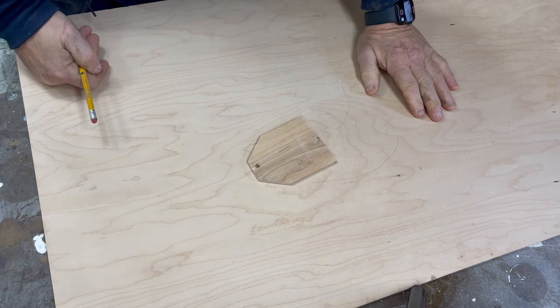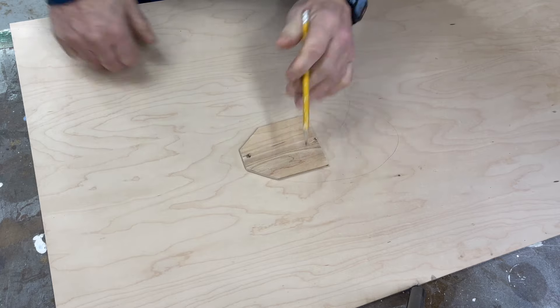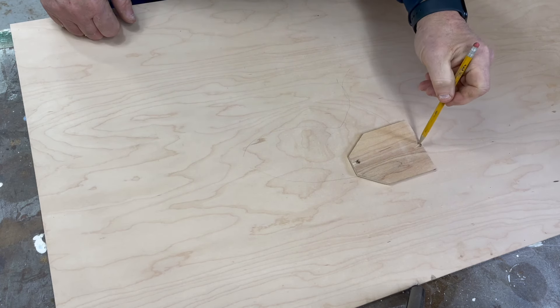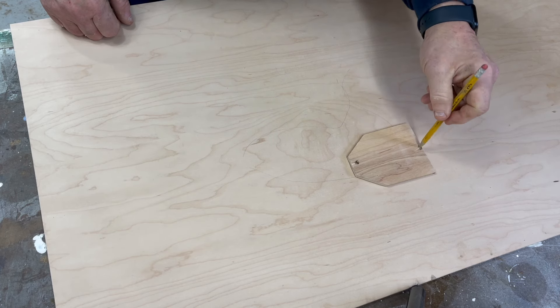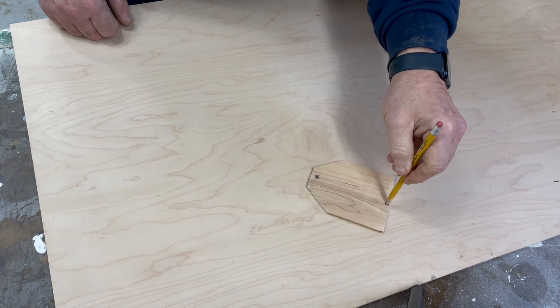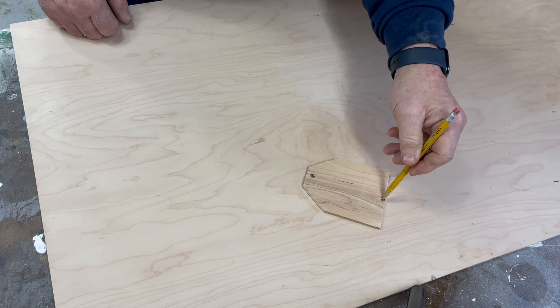I've had a couple of boats with electric motors — some in the back, some in the front and back — so I know what this is. Here's a rough boat, and mine is a little pudgy, kind of like this. We'll call this the front end. When you have any motor pushing from the back of the boat, it doesn't steer the front. What it does is steer the back and point the front. So if you're going this way and you want to turn, you turn the back end — the aft area — and then go forward.